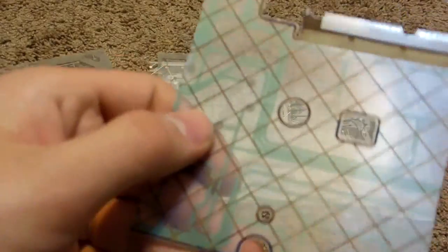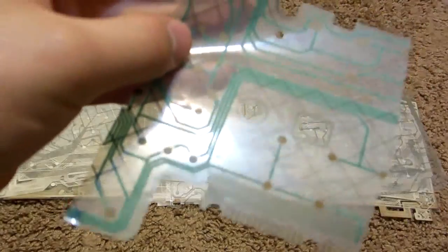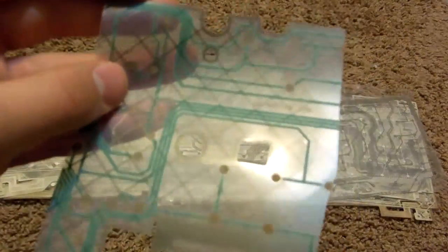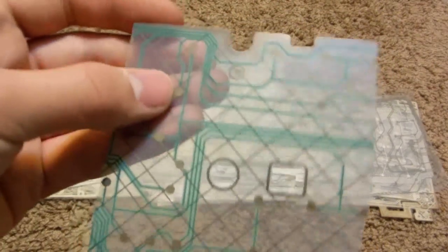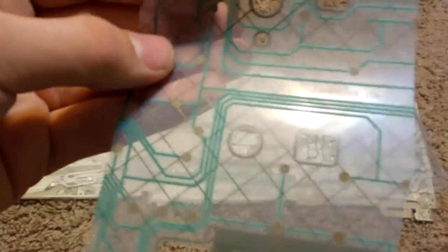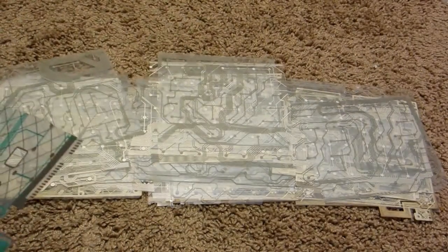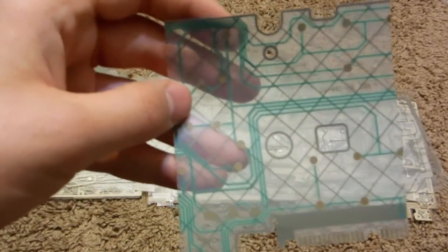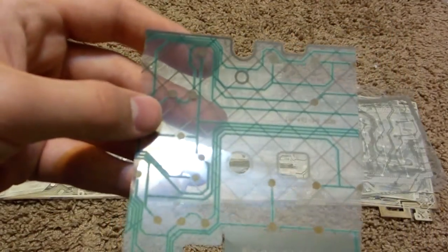Another kind of silver mylar is an acceptable one of semi-exposed pieces, where one side has exposed silver, and on the other side, the traces are covered other than the contact points. In most cases, the covered pieces can be cut away and processed with incineration, leaving behind silver traces with no covering. And then the silver traces left behind can be processed with the others, just like the ordinary mylars.